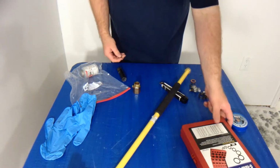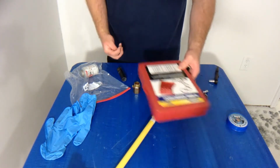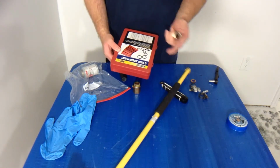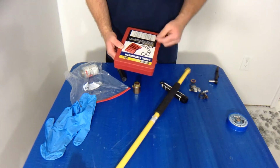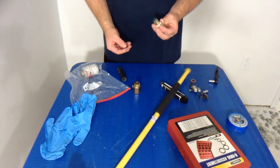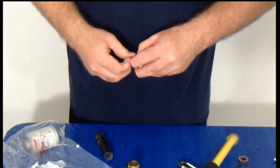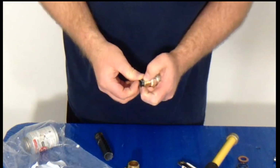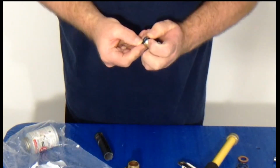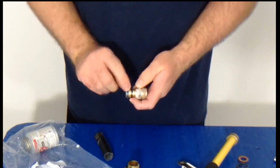And a little trick, so they can loosen up and spin and yet still seal, is to use some O-rings. I got these at Harbor Freight. They're crap for use in normal applications you'd use an O-ring for because they're sized wrong, but for oddball stuff like this, it works great. All you do is find the one that fits tightly, and slide it over, fit it into the groove.